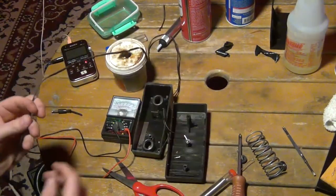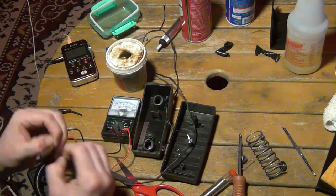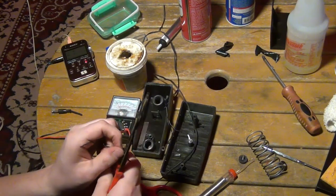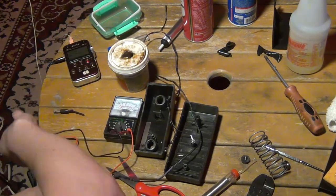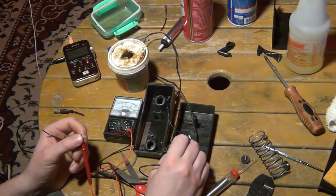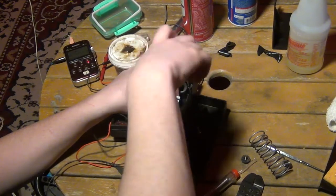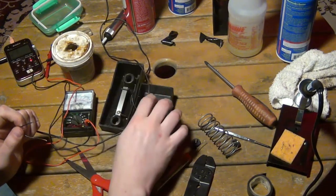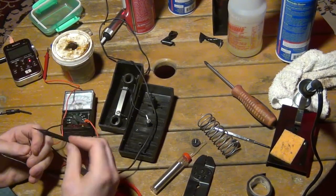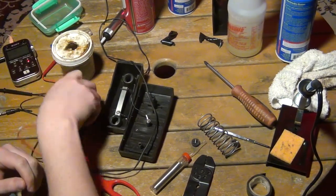Now just to be sure that there is actual continuity, so what I am going to do is open this one up, and now I am going to take the red, put it onto here, and then black onto here - and there is continuity, so there is no nonsense with this wire, so that is good. Alright so I got that screwed in - so now we are going to check the continuity between the one without the white line and this, and there is continuity between there, so looks like that is good to go.